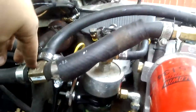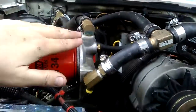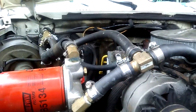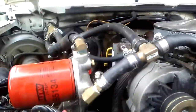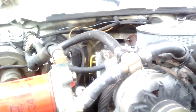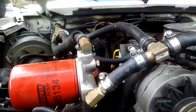I just used some brass tees and teed it off there. So I've got basically two returns — one side going into the filter and coming back up, and the other side just continuing on. That's typically how the other setups I've seen are installed. I could probably improve it — probably add a restriction valve on one feed so more coolant will flow through the filter — but I just haven't taken the time to mess with that.